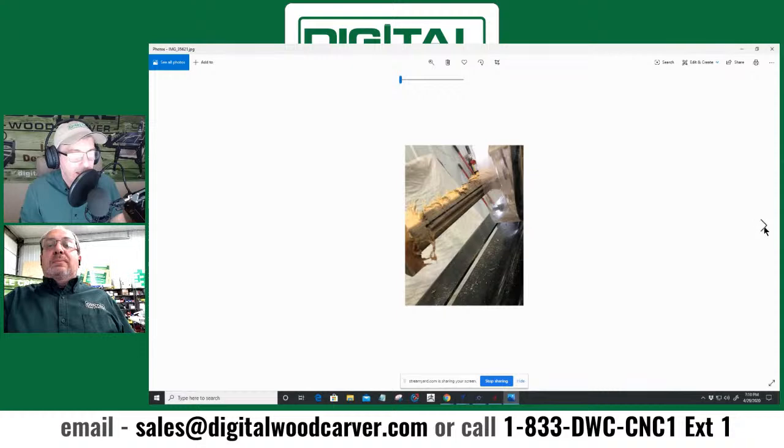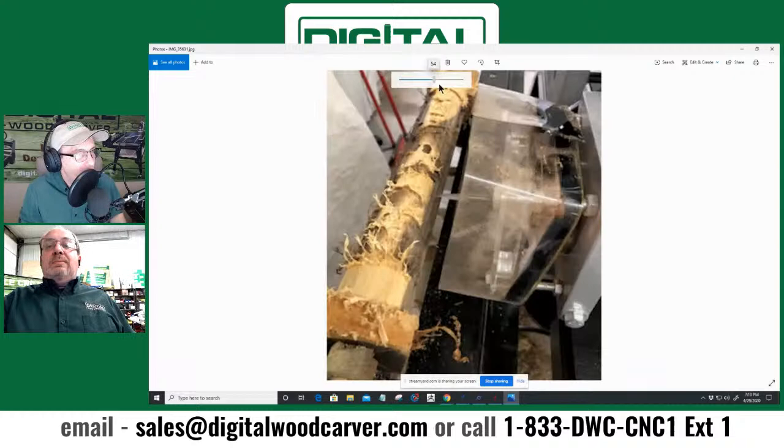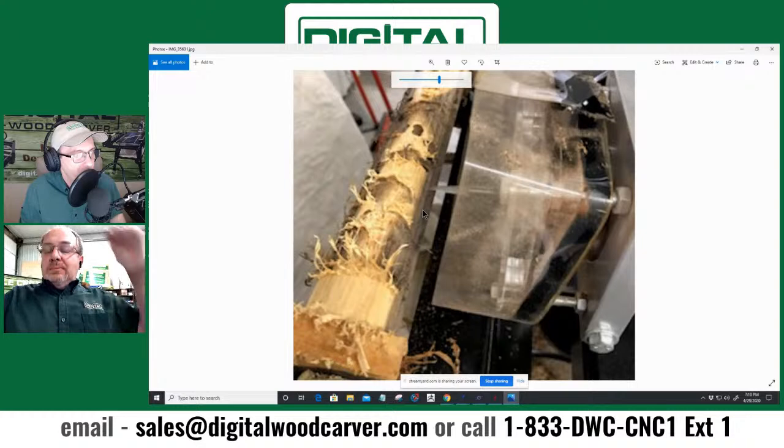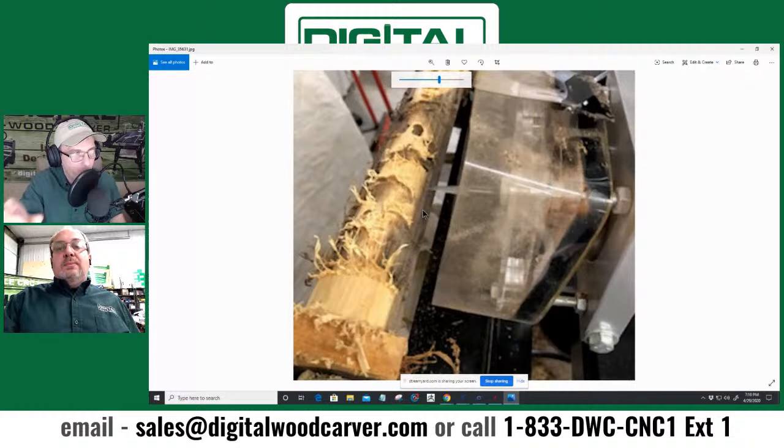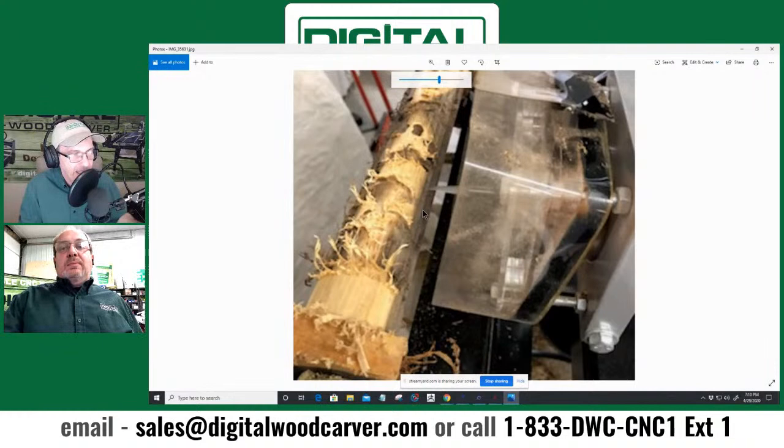But the ball nose bit is continuing to work around, again turning in that counterclockwise motion, and it's not a lathe. It's not high speed. It's not spinning real fast. That fourth axis is systematically turning as that router is traveling back and forth, doing the carving in and out, back and forth. And that fourth axis is just spinning that piece that we're carving based on the design and what's needed to be turned.